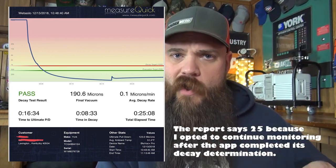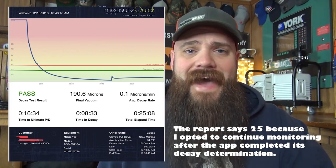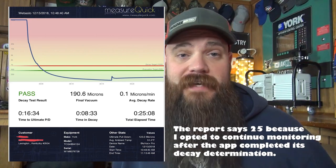That included our first and rough-in vacuum, our mid-stage and our deep vacuum, as well as the decay portion of seeing what our rise was after we valved and isolated the pump from the system. We used a 2 CFM pump with three-quarter inch inner diameter hoses and we easily matched the speed that would have taken somebody with an 8 CFM pump with quarter inch hoses, or going through a manifold.